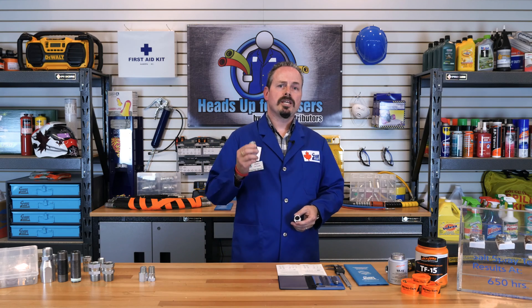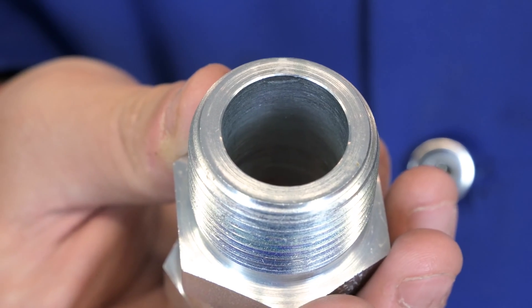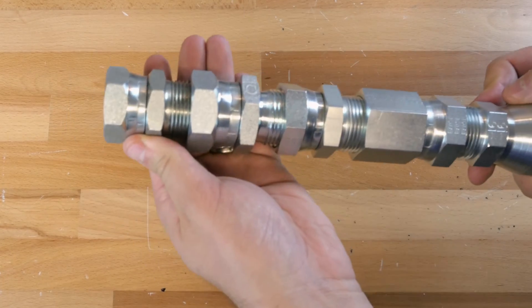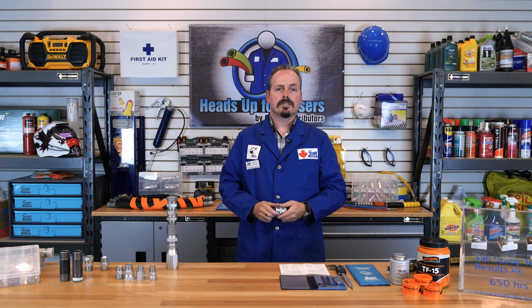It is important to note that if you want to determine if an NPTF fitting will mate with a female NPSM, you need to confirm that there is a 30-degree seat present in the male fitting. This should not be confused with a slight deburr point present on all NPTF and NPT fittings, as this will not provide a seat to seal on. Not all NPTF fittings will have this seat, as Aeroquip does not want to promote the stacking of adapters. Creating a chain of adapters might be a quick and cheap solution, but with every additional adapter you increase the chance of leak points. Also, with more adapters you increase the chance of restriction in the system that could heat up the hydraulic fluid inside and cause the system to break down prematurely. So most NPTF adapters will not have the internal 30-degree seat, but they do exist if you need this connection.